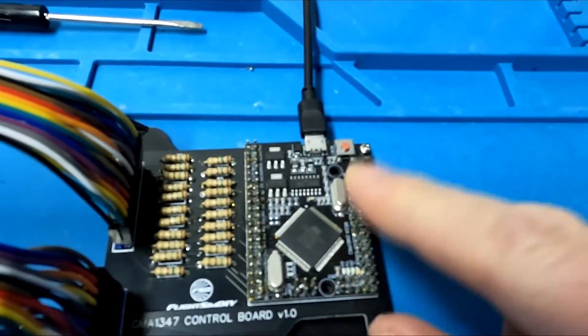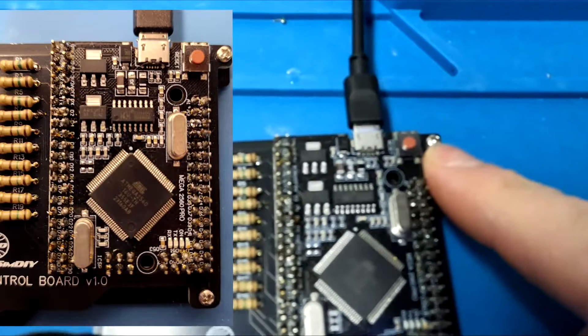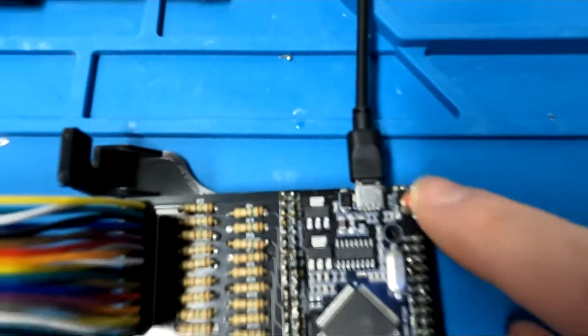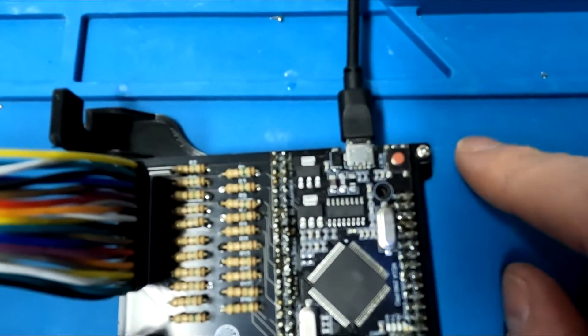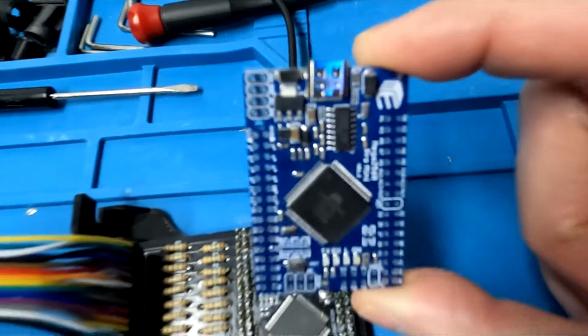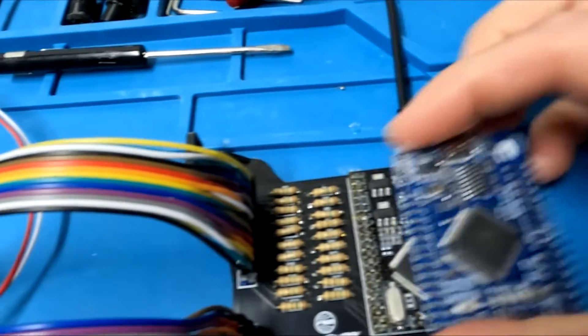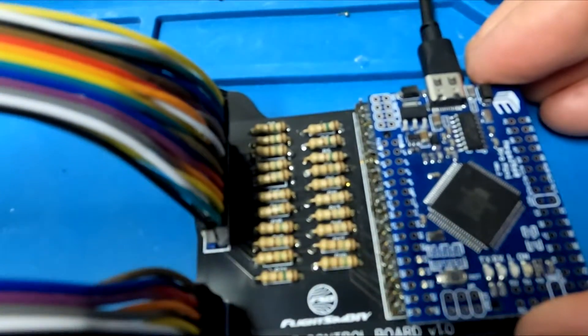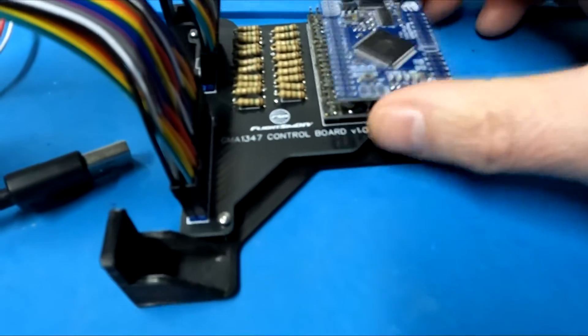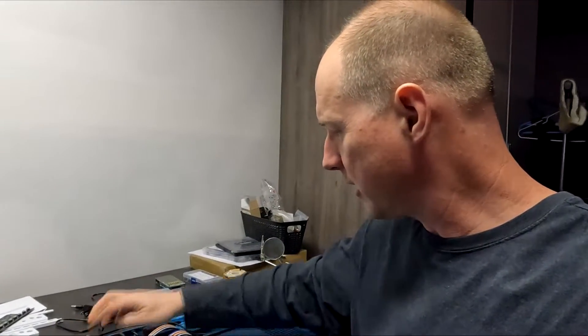One thing you do need to watch: this is the Arduino Mega 2560 Pro Mini. If you buy one, just be aware there's more than one version out there. Look for the one with the red push button in the top corner — that's the reset button on the Arduino. Don't make the mistake I did. There's also an Arduino Mega 2560 Mini Pro which looks pretty similar, same size, but uses USB-C where this one is micro USB. If you lay them on top of each other, this one is a whole row of pins shorter and won't fit on the circuit board. Be super mindful when buying your Arduino — look for that red reset button.